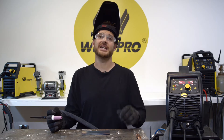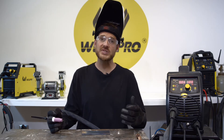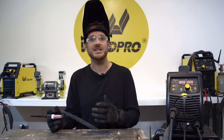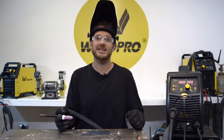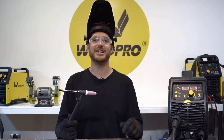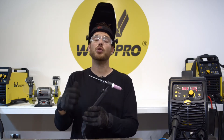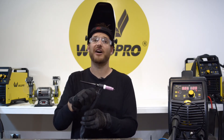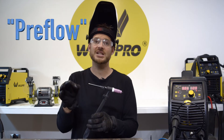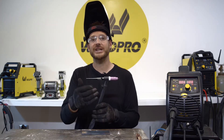To run these passes today, I've prepared an eighth-inch strip of steel. With TIG it's very important that the material is clean — the tungsten can get easily contaminated if mill scale from hot-rolled mild steel contacts it. A couple of quick notes before we strike an arc: this torch has a gas valve on it, and we're going to open this gas valve prior to touching our tungsten and lifting it off the plate. This will start our shielding gas flow ahead of the arc.